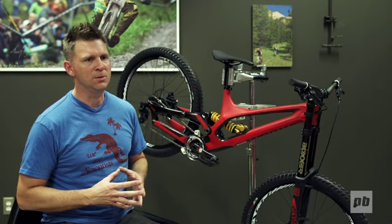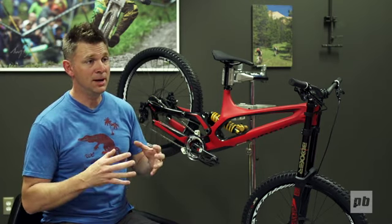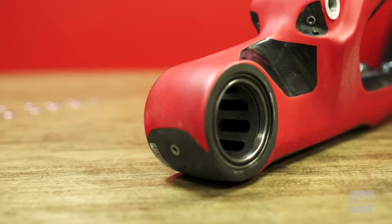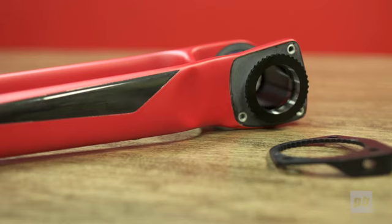And naturally what happened was the main pivot moved into the same real estate as the bottom bracket. So it became natural just to integrate those into one pivot. Then I reconfigured all the other pivots around that. So the FSR 4-bar performance is still there, even though the pivots are in a radically different location.